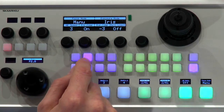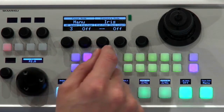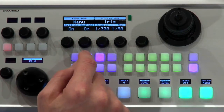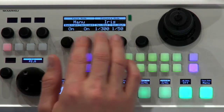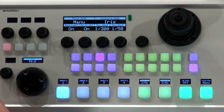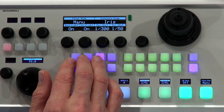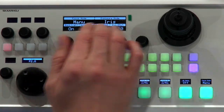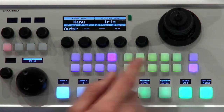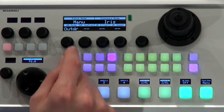If I go to this menu, you have speed, exposure compensation on/off, gain limit, and so forth — you have all seen this in the RCP. But in this case, because I have only four encoders here and I am disregarding this other section for now, I have to map them slightly differently. For the most important features, I just made them available like that. And I'm also using shift keys here. For white balance mode, you can see I have some white balance options available.